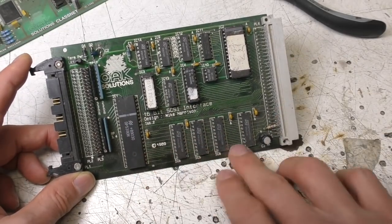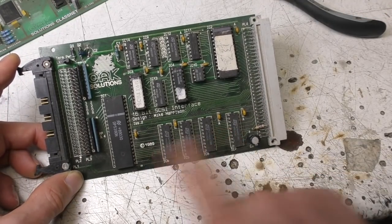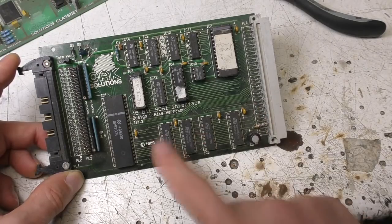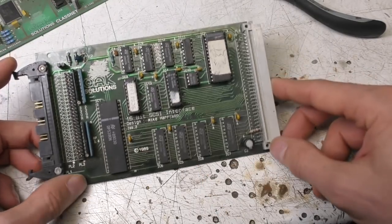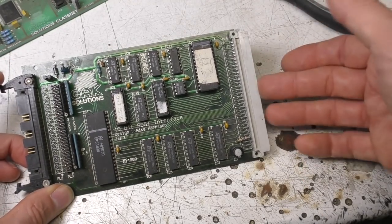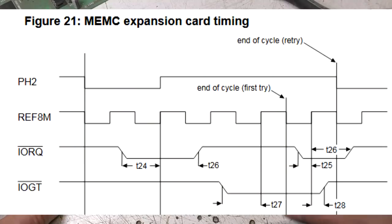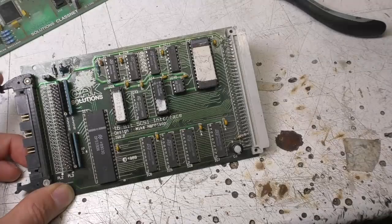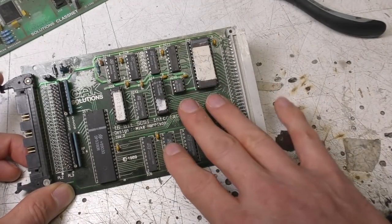And we actually operated this in a 16-bit mode, so we used the 16-bit bus on the machine, and these are just some latches so that we could transfer 2 bytes at a time in each direction, which gave us quite a decent amount of speed. But I also did some tricks with the backplane bus interface. It was an 8 megahertz 16-bit bus, and there was a mechanism for clock stretching so that you could have different speed peripherals, and the peripheral would provide a signal to synchronize it so that it would go just as slow as the board needed.